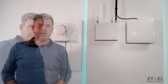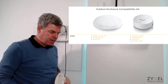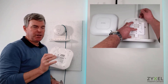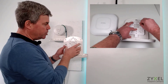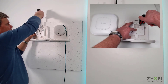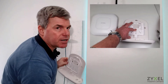That's all for the wall mounting. The outdoor enclosure is made for a round access point like the NWA5123AC. However, we also have the WAX610D which uses a square mounting plate. For this we need to modify the enclosure slightly by using the original plate and the screws that come with the device. Fix the mounting plate three centimeters down from the edge of the original plate and screw the device mounting plate tight to the back side.